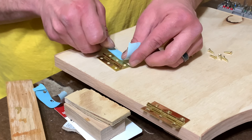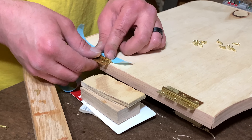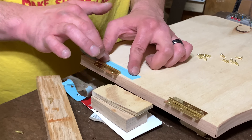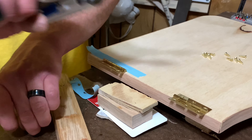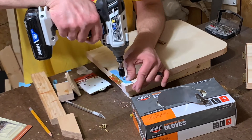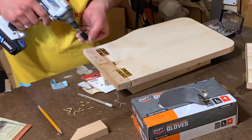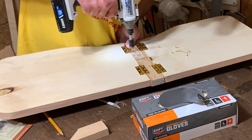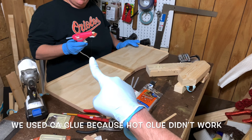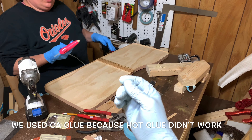Try two. We've already put on the hinge. One thing I found is by putting a little piece of blue tape over it, it'll allow you to line the hinge up exactly where you want it — you can put it down and still find your holes to then screw in your screws. We are also doing things differently by using hot glue instead of wood glue to put a seal all the way around so that the resin doesn't leak through.